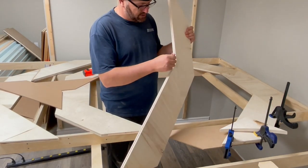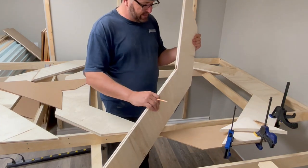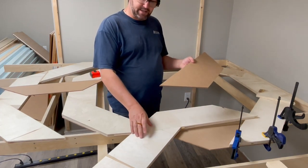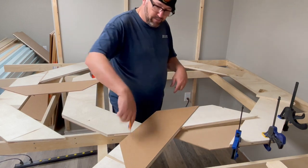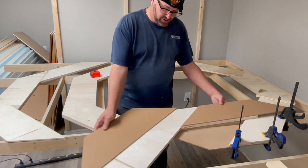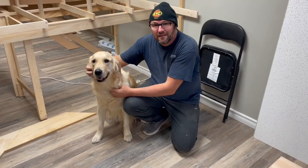I left that piece to show you it was cut with the table saw. I fit that piece of masonite into the groove, then I glued and nailed it to hold everything together, which makes a nice strong piece. I've cut a piece of masonite to match the same angles as all the helix pieces, and now I'm going to glue and tack-nail with a brad nailer so they go all the way around, overlapping on the opposite joint line — making it all secure and one piece once it's built.